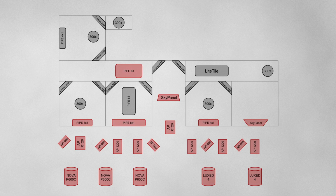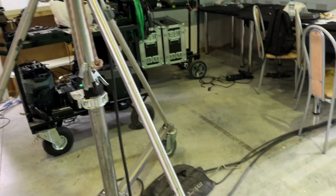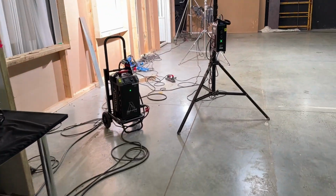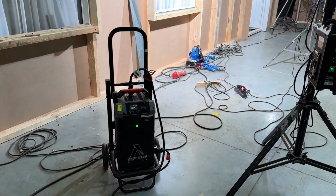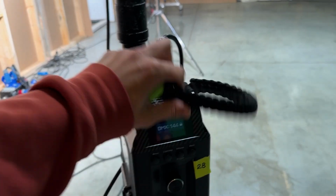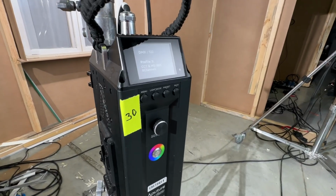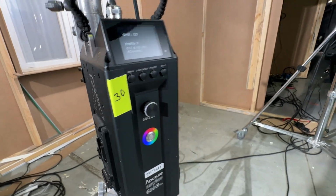Here's the diagram with all CRMX connected fixtures. These are fixtures with built-in CRMX receivers: Aputure 1200, 2600, 600, Nova 600, Nux bulbs, Infinibars, Lightstar, Lux 4. Note that Aputure 600D first gen doesn't have CRMX, only Pro versions and later X and C versions do.